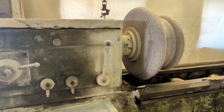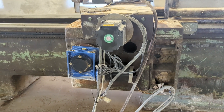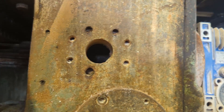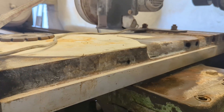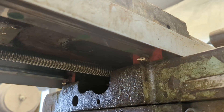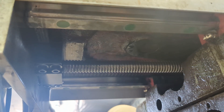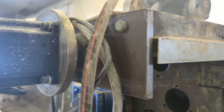And here are the Y and Z axes. The Y axis is driven by a 12 Nm motor, which I installed through the worm gear directly instead of the manual movement handwheel of the carriage. The Z axis, on the other hand, has undergone more serious changes. I had to mill all the original guides and install modern rail guides. I also replaced the screw with a ball screw. All this is controlled by a stepper motor with 12 Nm of torque.